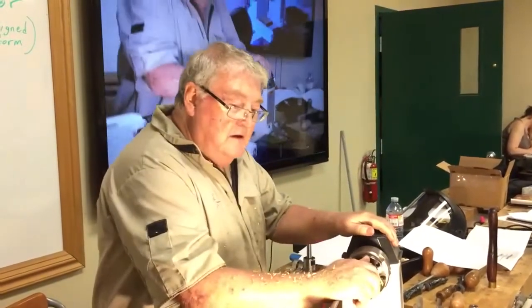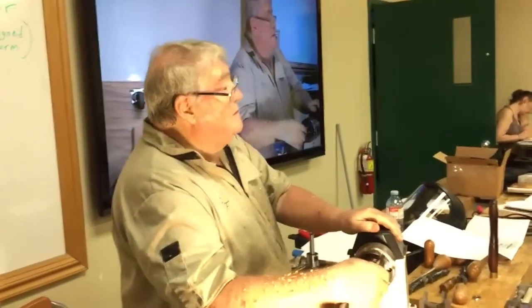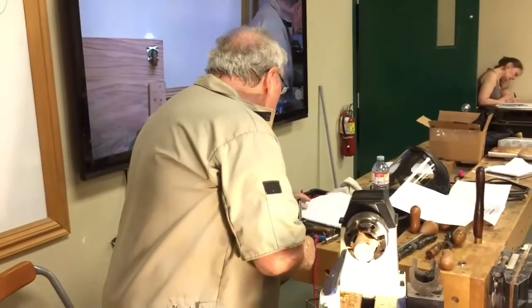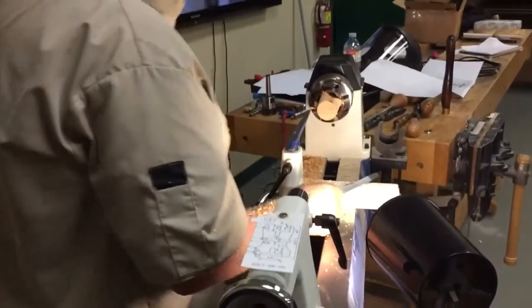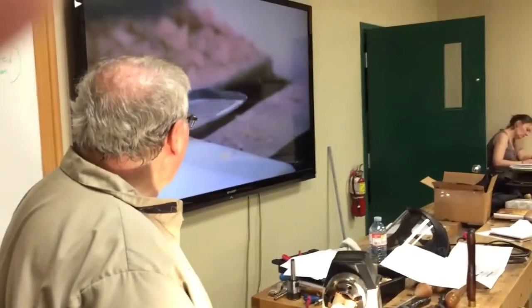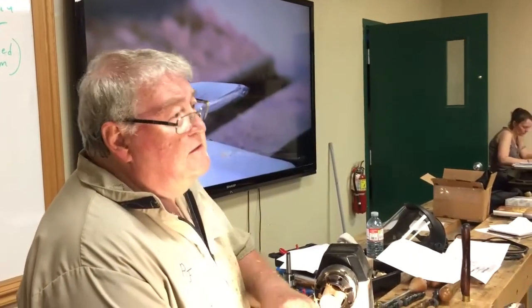I conclude from that that there seems to be a sweet spot around 37 and a half degrees, I found, because I arrived at 37 and a half degrees by trial and error, when I was making this little gouge here, that a few of you have seen before. I called it a brush gouge because I first made this gouge from Myron Curtis, and we now have his video in our DVDs. Very hard to find videos by Myron Curtis. I found it in the AAW, and they don't have them very often, but we have one now.